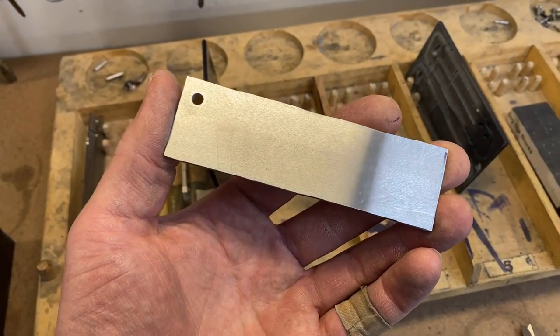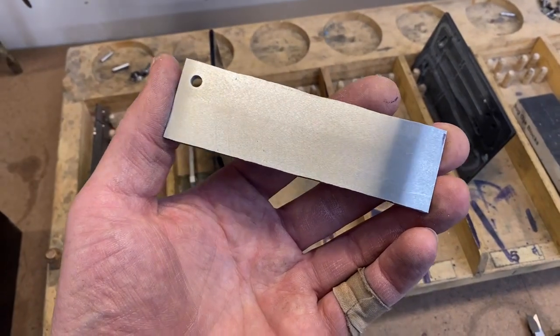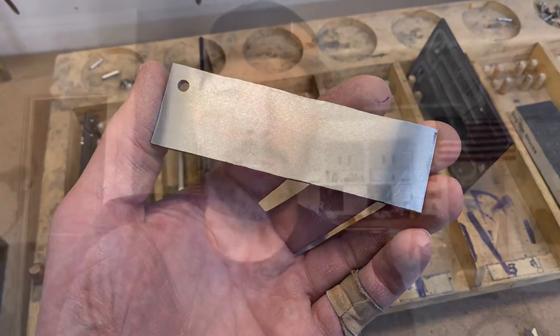I'm going to use a new special steel to demonstrate how this is done. It is yet unnamed because they are working on a trademark for that name, so I can't call it anything but 'the new steel.' The coolest thing about this steel: it was designed by Larrin over at KnifesteelNerds.com. If you want any information on the properties, heat treat process, or any knowledge about steel in a knife, go to KnifesteelNerds.com. This steel was designed to be similar to CPM 4V or Vanadis 4 Extra, but a stainless version — and its stainless properties are actually better than M390.